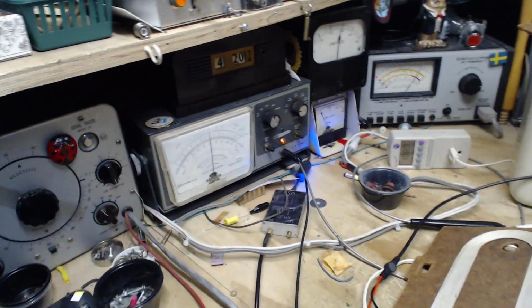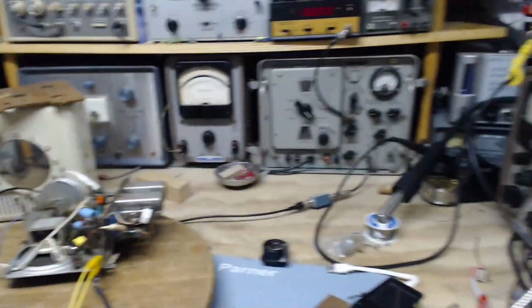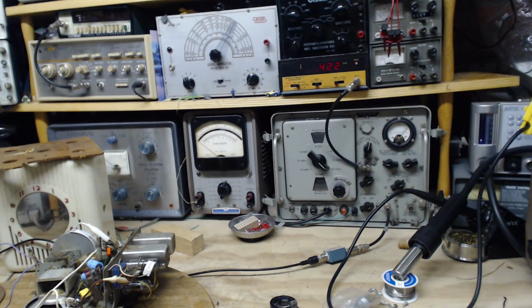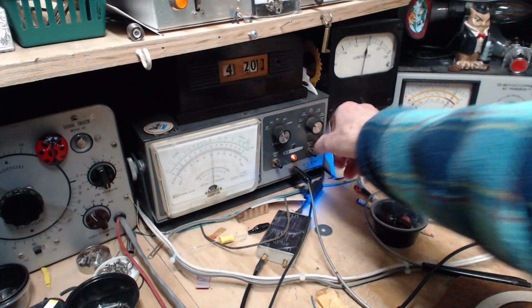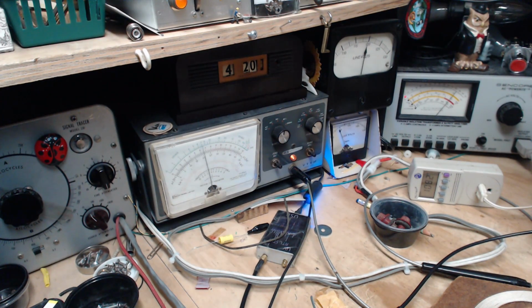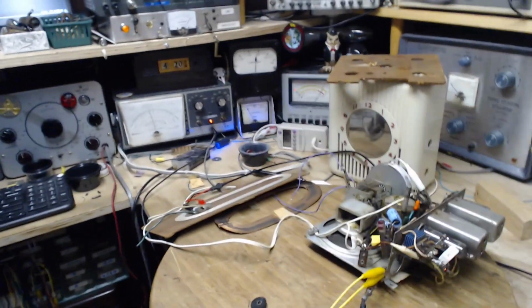is right there. But right now my frequency counter is taking a break. It's lost its mind briefly. That'll come around in a moment. There we are. Oh, 422. Wow. That's surprising. I thought I could hear it better at 455. Oh my gosh. There's two distinct peaks here. This is the 455. Now I'm going to go down. There's another one. Okay. So that's 455 there. I'm going to turn the volume down so we don't listen to it. There we go.